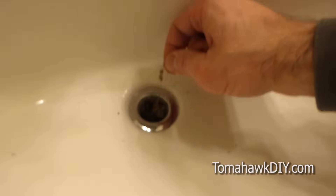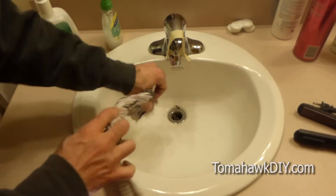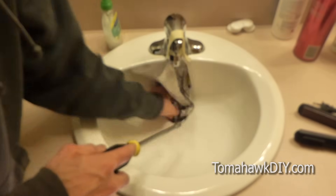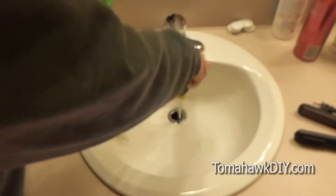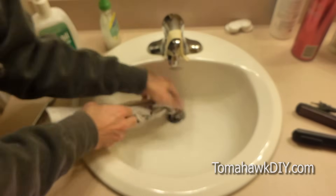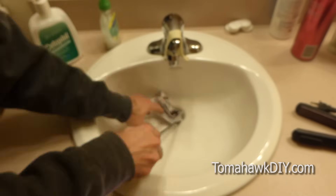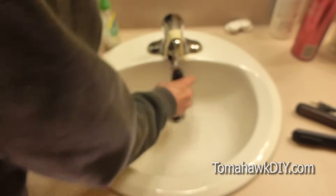You can see all this hair and other junk backed up in here. So to clean it out, I like to take a newspaper and work it down — it's going to kind of chase everything down into the bucket below. I'm going to use this big screwdriver to help push this down once my fingers can't get it anymore, and pull that out of the bottom. Now obviously make sure you've taken the P-trap off down below before you start sending the newspaper down, otherwise it's not going to work. You could use paper towels or some other soft, flexible paper if you do this.